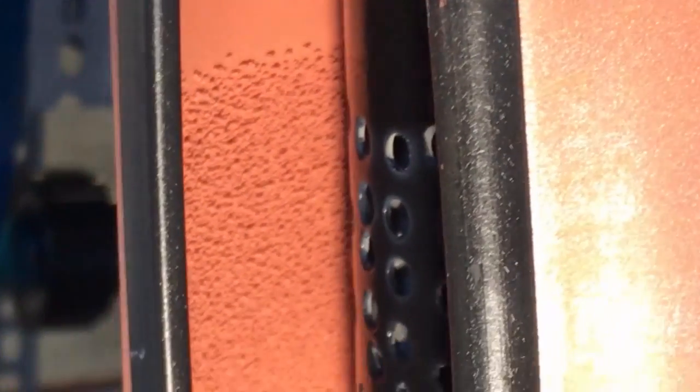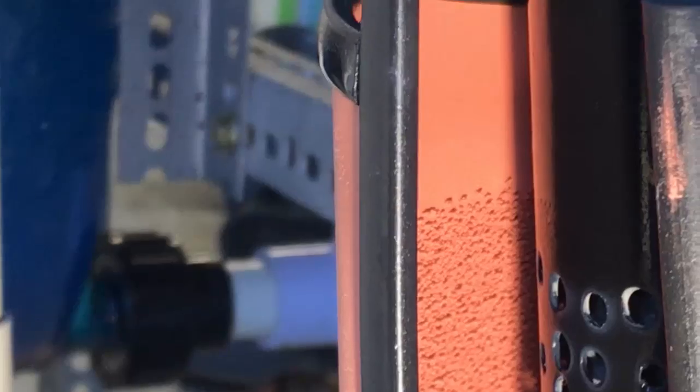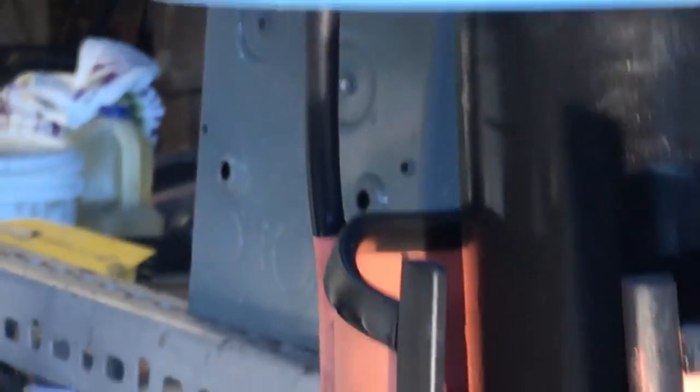We got those nodules there. It could also be a problem with my plating surface — it may be too rough still. It was not a smooth piece of stainless steel that I used, and it's very important that you have a smooth piece of stainless steel. It does appear that we collected a lot of copper in that short amount of time. The anode looks great. The coating is working.